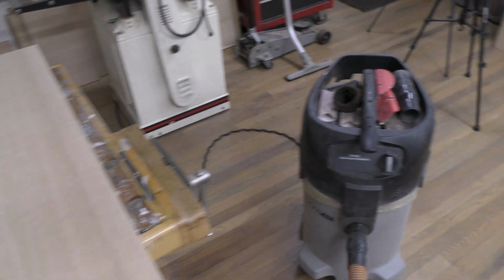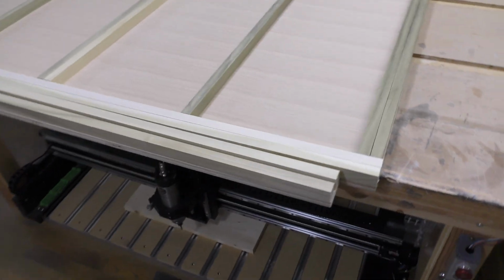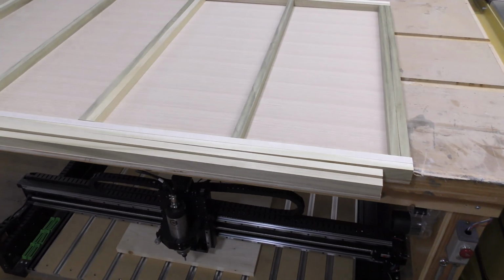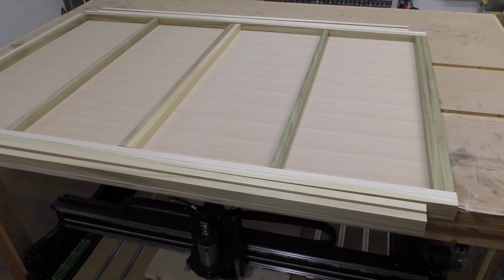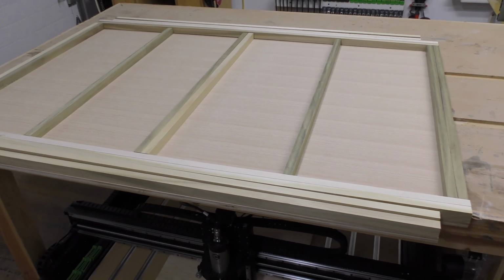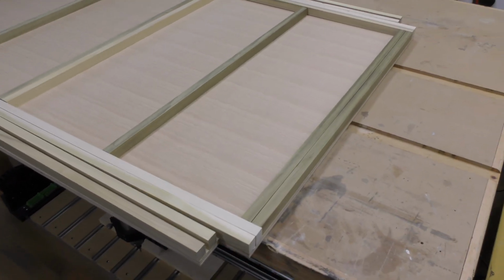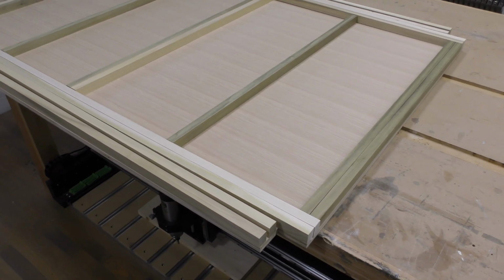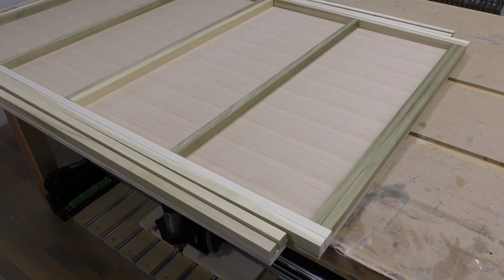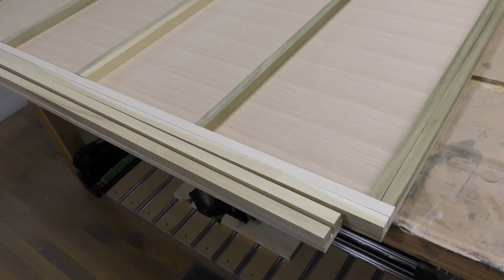So now I also want to show you how the top will be put together. This is the underside of the top, right? So if that was the top skin, this is the skeleton that goes in between, and the lower part of it, the underside that you don't see. Basically what I've done is created a rib system that will hold the table straight and give me the thickness that I need for the 2 1/4 thick top that we're looking for. It also gives me a system in which to mount the legs to.